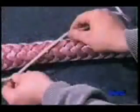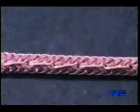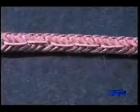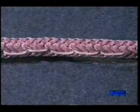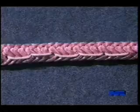Since the buried eye splice is prone to failure through loosening, it's often a good idea to cross-sew the splice. Cross-sewing does not strengthen the splice — rather, it keeps the splice from working apart during normal handling. If the splice is used in a static environment where it's not handled much, cross-sewing offers little if any value. Use a nylon braided cord that is about one half to one third the diameter of the rope strands. Never use spectra, plasma, or kevlar rope as your sewing thread — nylon cord has elongation and will give as the splice works. At this point, our cross-sewn buried eye splice is done. Remember to use this splice with caution as there's always the possibility of slippage, and remember to inspect the splice from time to time.